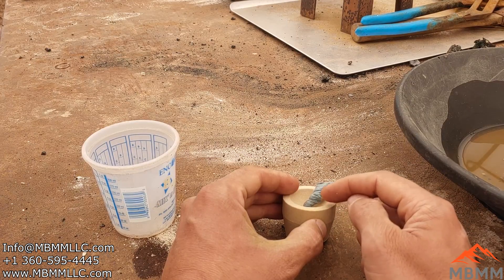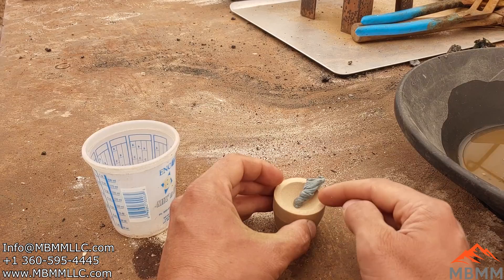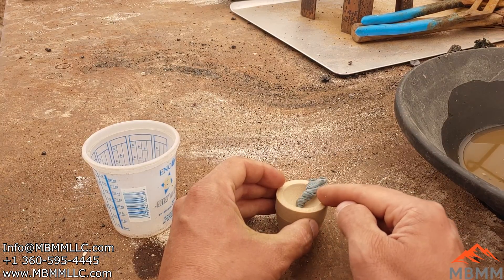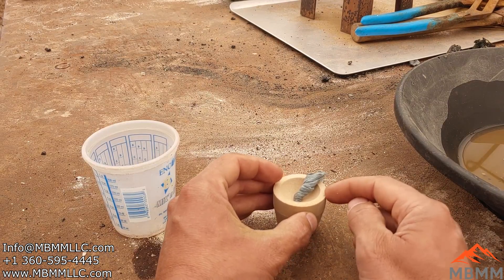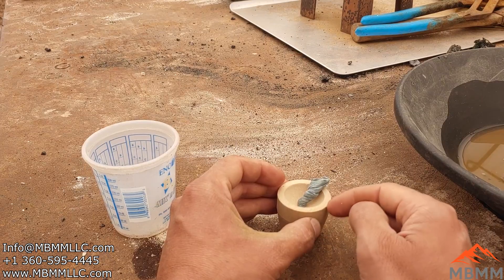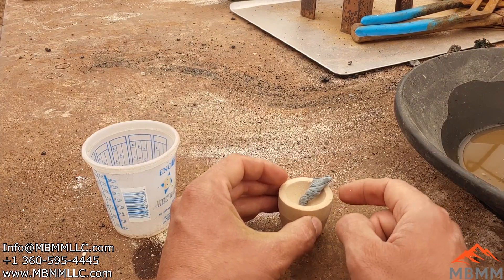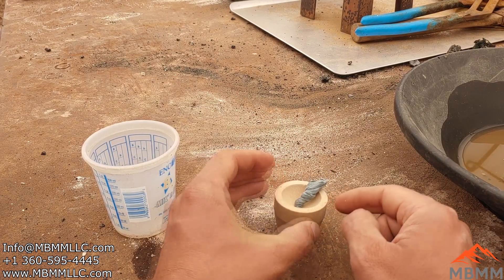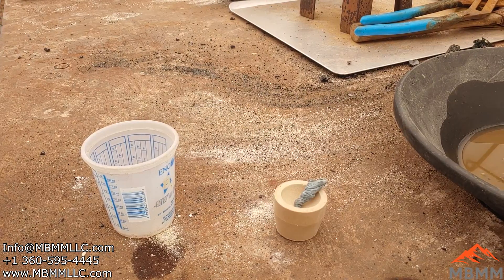I'm going to add some bismuth or lead — I'll use lead as an example. Lead melts at a fairly low temperature and it alloys with all the gold, silver, and everything in our pouch. Then as it heats up to about 1,600 degrees Fahrenheit, the lead oxides that form on the surface of the puddle start to melt. Because the metal forms a concave dome, the molten lead oxide runs off and is absorbed by the cupel — it's like a sponge for metal oxides. The cupel absorbs the metal oxides but not the metal itself. So it absorbs all the lead oxide, plus any copper or iron — all that gets oxidized and rolled off into the cupel. When all the base metals are fully oxidized away, you have your gold left in a little button in the center. We'll get the furnace heated up, put this in, and see if we get our little gold bead, then weigh it and figure out how much gold we got.